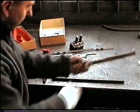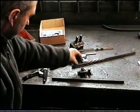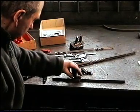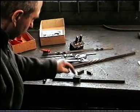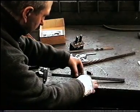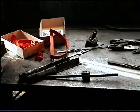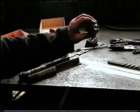All you need is to cut six pieces off 12 mm square bar, one there, you weld across there, weld across there and the back, and the same again on the opposite side, so you sandwich the bar all the way around. Welded those six pieces together.